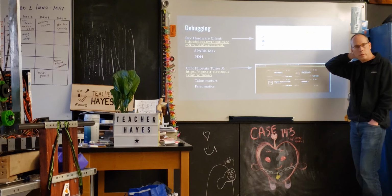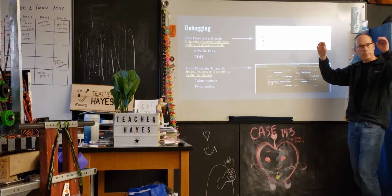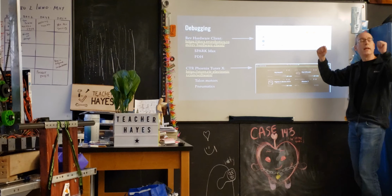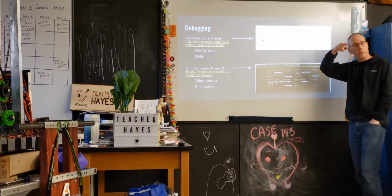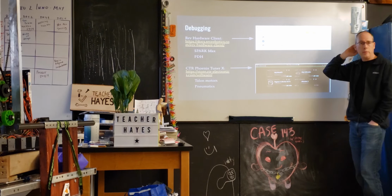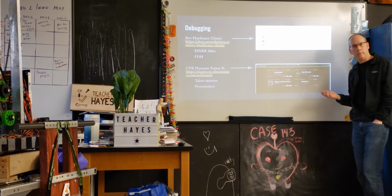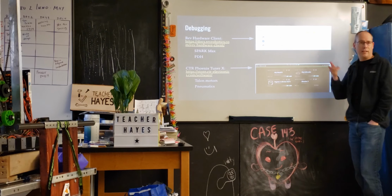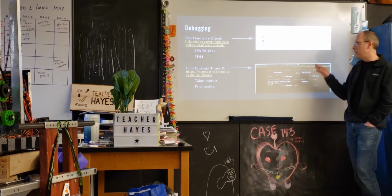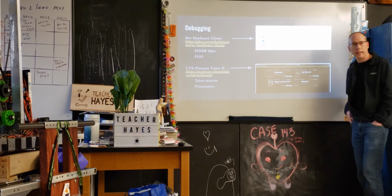If you remember, some of you may remember from last year, you're hanging the robot and it wasn't in stop mode? What do you call it? Brake mode. Brake mode was a firmware setting on one of these. You can sometimes override it with software as well, but in that case I think we didn't. But you can set it here, and I remember that was how we initially debugged it. We weren't sure it was in brake mode. We used this, we saw it wasn't. We tried it, and it actually changed the way the thing behaved. So it's actually a good way to debug items like that. But we'll open it up and show you how it actually looks on the robots.